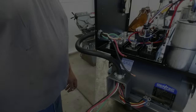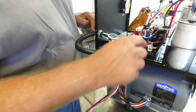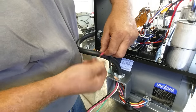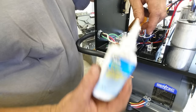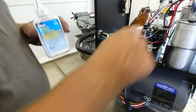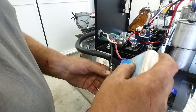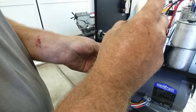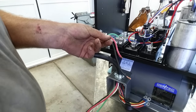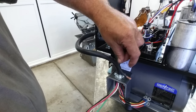We've got our cable installed, Romex connectors in, cables ready to go into the three lugs — black, red, and white. We're going to use Noalox on these connections. Why? We've got copper wire, aluminum lugs, and steel cadmium-plated set screws — three dissimilar metals. To add insult to injury, we're passing electricity through them. So we put Noalox on all dissimilar metal connections.